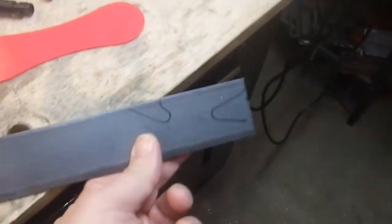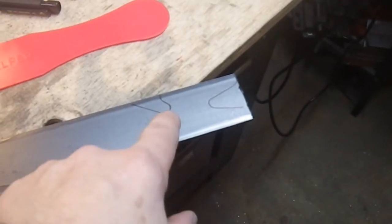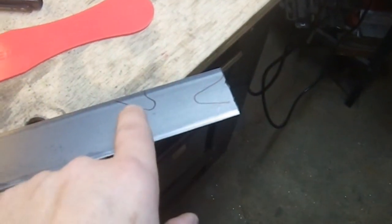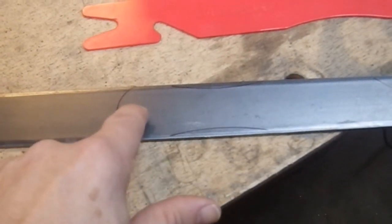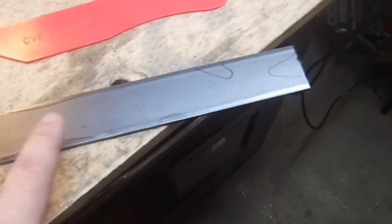So I've already sketched out the outline here on this, so I am going to cut it off. I need to do some layout lines, because I want to find whichever of my Blair rotobroach bits is the correct diameter. I think those are the same, or if they aren't, they're going to be. And then I'll put a mark here so I can drill a hole for hanging it. Once I've got that marked, I'll drill it and then we'll start the whole shaping process.